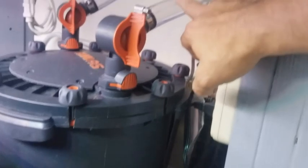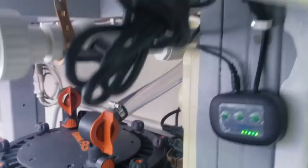a hose bib on it, which you can connect to PVC piping and then make a modification. Let's see if we can get it here. A hose bib connected to there, and then you can drop down from a 1 inch to a 3/4, and then go into a 45, come up, and then this now becomes your flow valve. I know it's not as flexible as using a flex hose, but as long as you got all your angles right, everything should flow good.